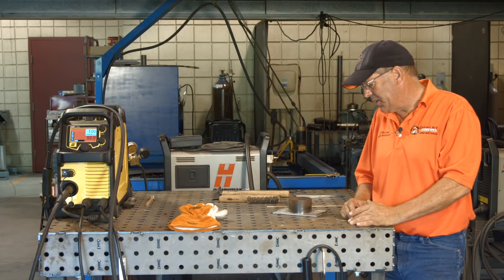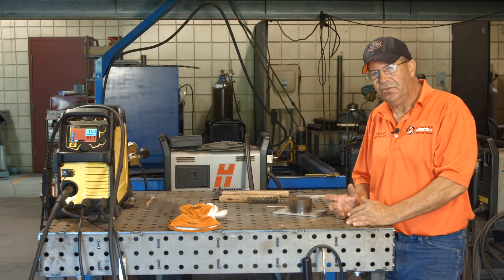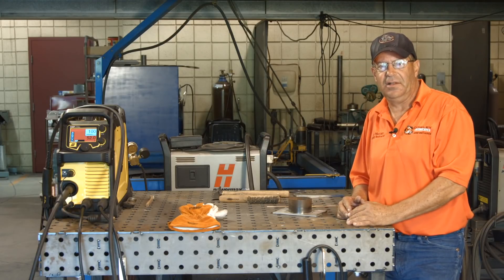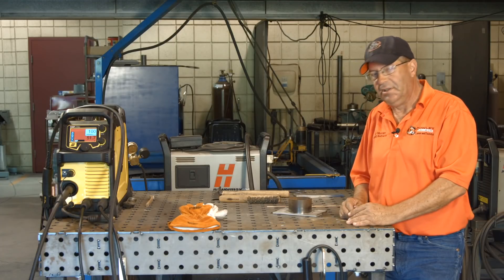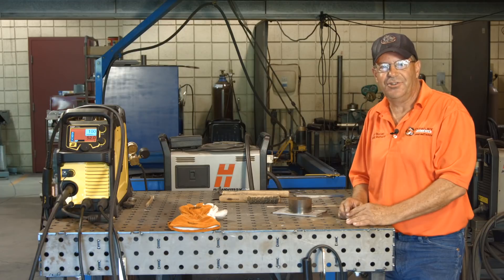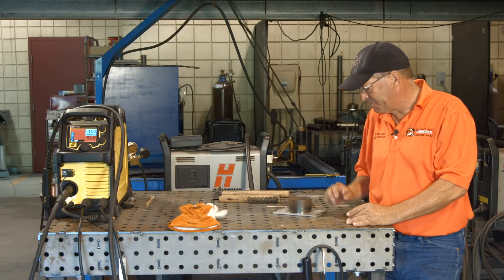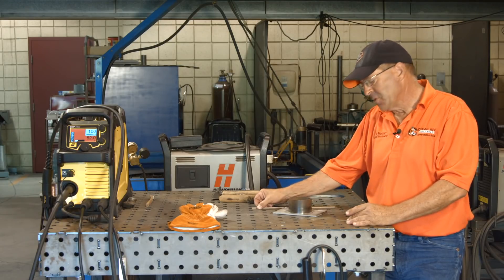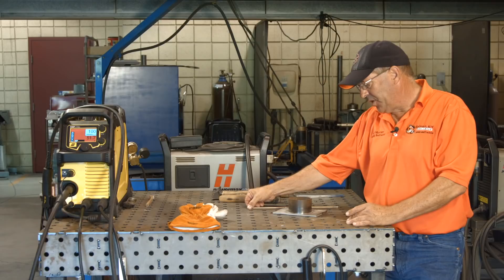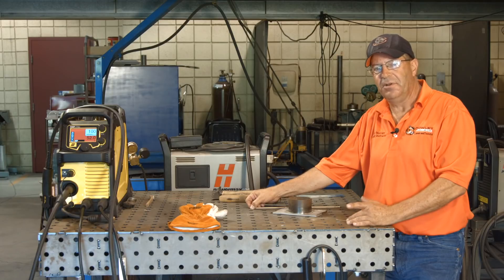It's really not hard. The main thing to consider is we really need to take care of the stainless alloy. You would not want to weld this with a carbon steel electrode like low hydrogen, so we would pick an alloy. The most popular right now is 309. I used to use a lot of 310 back in the day — there were procedures running 310 stick rod for doing carbon to stainless.